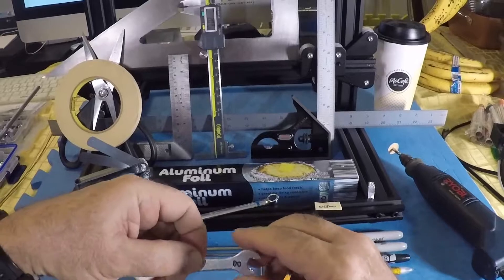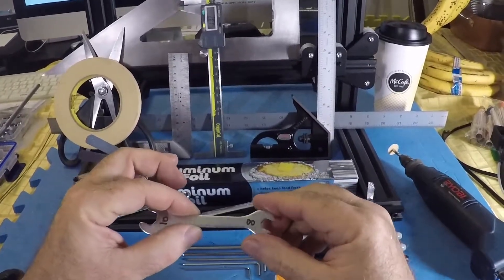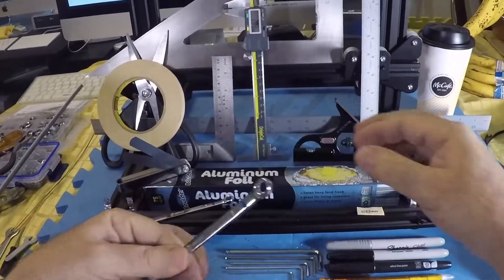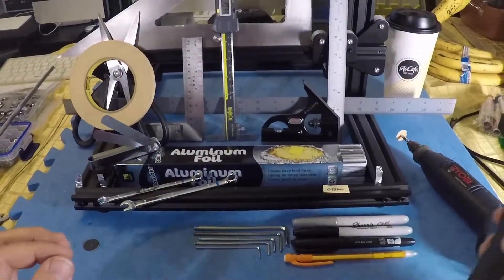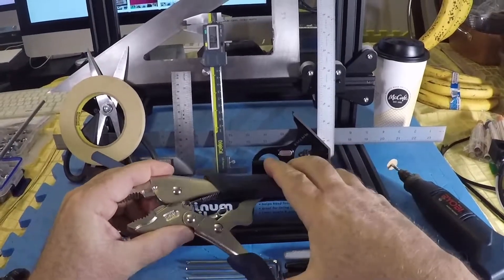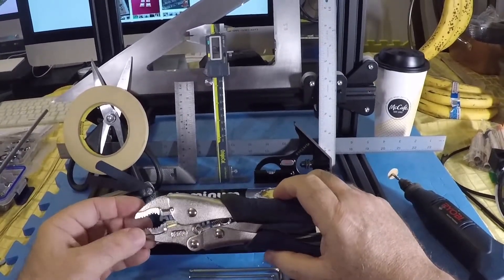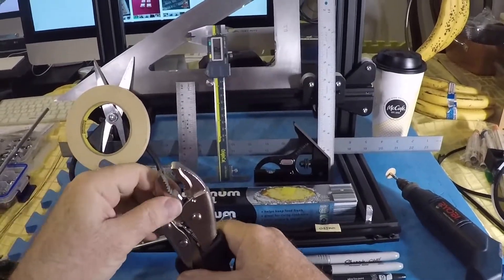For the next tool they give you, they give you one with an 8mm and a 10mm. The 8mm is very commonly used because it fits the back of the V-wheels and a lot of the 5mm Allen head socket screws. So I got an 8mm again to replace this one — it's just done so much better. This next tool is not essential, but I actually like using a vice grip sometimes over the wrench. You have to be gentle with it. You can adjust it to just barely snug onto the back of the 5mm nut you're working on. I like it because I can adjust it to any tension I need, and with the weight of it, I often need a third hand — I can just sit it here while I'm adjusting with the Allen on the other side.